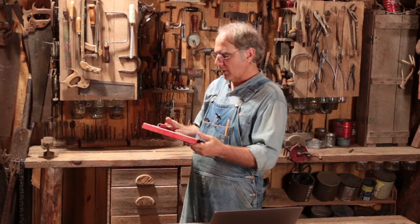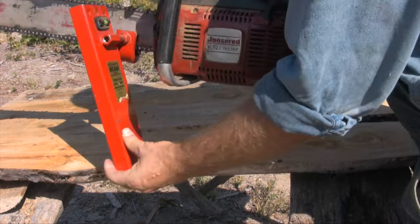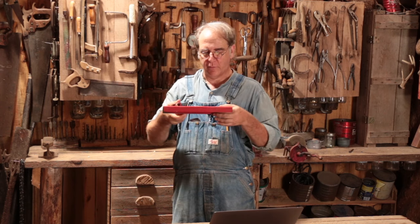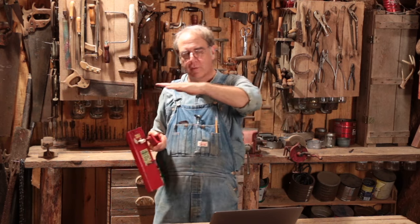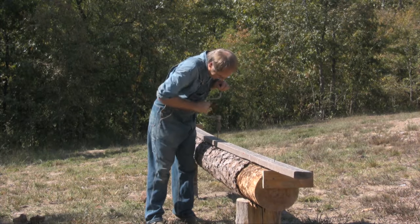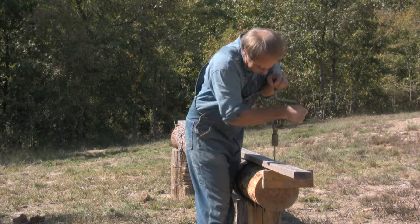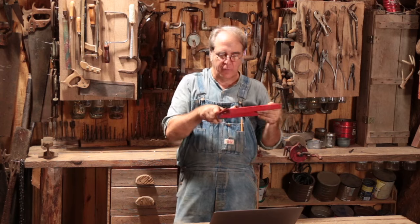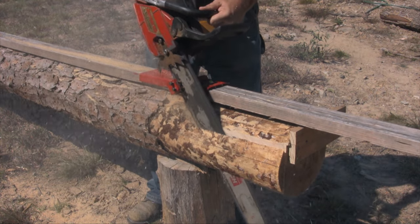It's very simple to operate. It just attaches to the blade of the chainsaw — you just want to make sure your chain doesn't hit the metal here when you're attaching it. Get it good and snug on there. Then this device just rides a 2x4. You buy any old 2x4, or mill one yourself, and place that 2x4 on the log. Screw it down — I use 3-inch screws — screw that 2x4 down to where it's basically level. If your log is crooked, you might want to add some shims underneath for support.